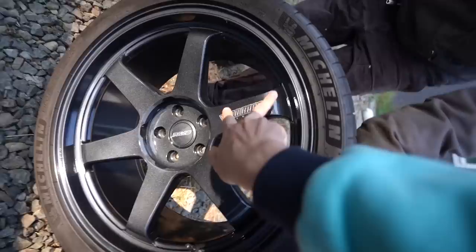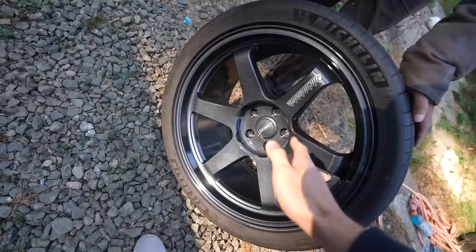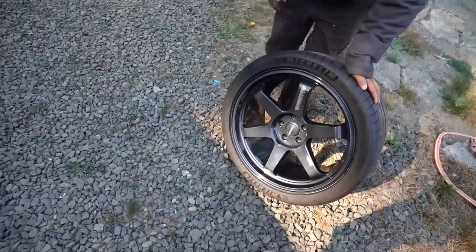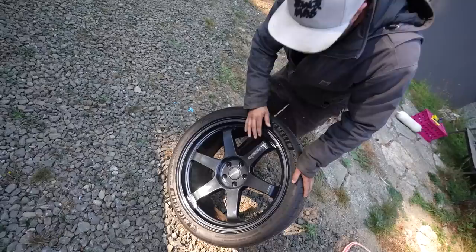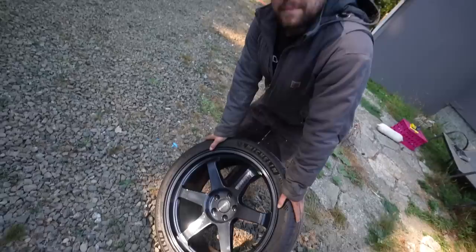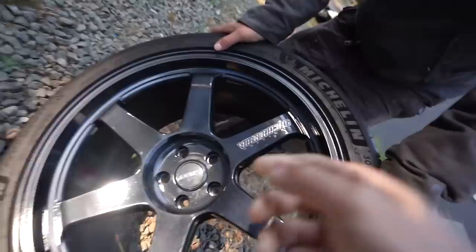The most difficult thing by far was I wanted the Volk Racing stamp back in the kind of metal engrave that M spec and diamond black finished TEs would usually come in, and he was able to do that. This isn't just white — this has got like a full silver metal sparkle to it along with on the center cap. Do you want to explain how you even did that? Basically I finish the wheel entirely and then go back through and actually fill it with powder, then remove everything I don't want coated. It's a little bit of a challenge getting the same exact finish evenly, but it turns out really, really well.